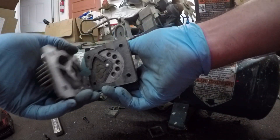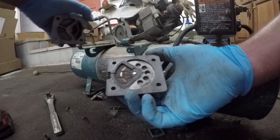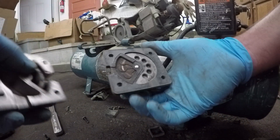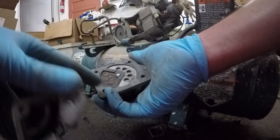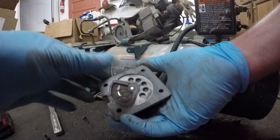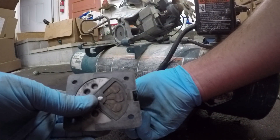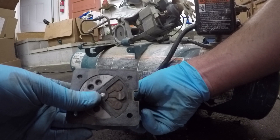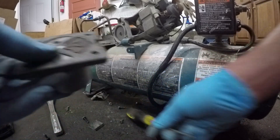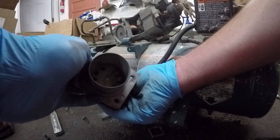This is how this was oriented on the part. When you split it open, you can see this little notch on both sides — that's where the line out went that allowed the pressure to go down and into the tank. So that is going to be our outlet side, and the other side is going to be our air inlet. All the way around, you'll see a bunch of circular holes that go through that piece of metal. On the other side, in the little pie-cut piece, you'll see three little sticks of metal that cover those — these are diaphragm valves. The other five holes have that exact same type of valve on the other side of the surface.